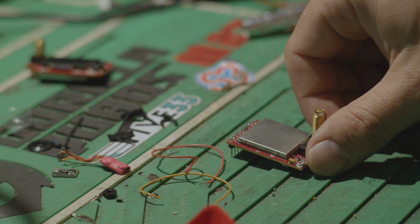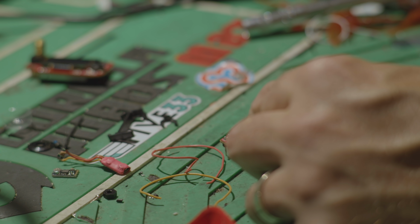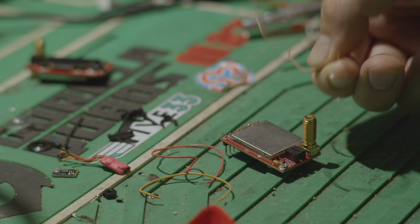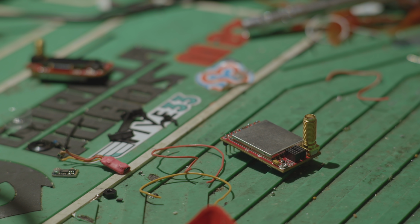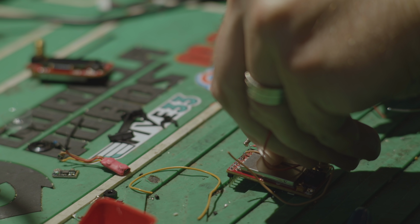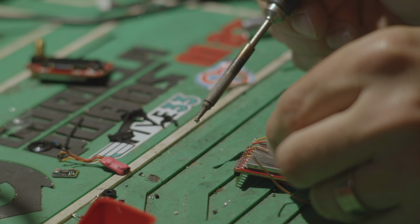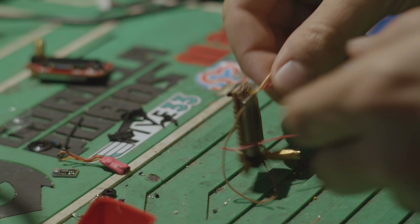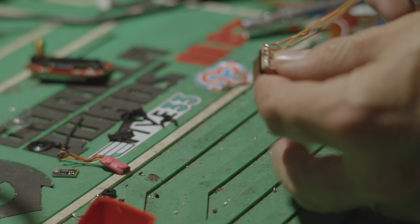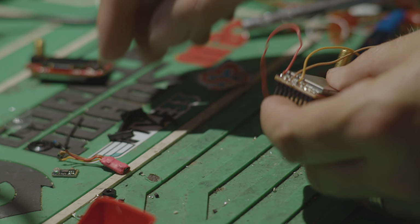And then a pro tip is to wire the wires coming back in towards the device rather than out and away, because the way that you're going to run the wires later inside the goggles will benefit from having the wires run backwards. So here's the ground wire, here's the 5-volt, and here's the audio. Okay, so with that we can put the two halves back together and just make sure we run the wires out of the machine, out of the device.